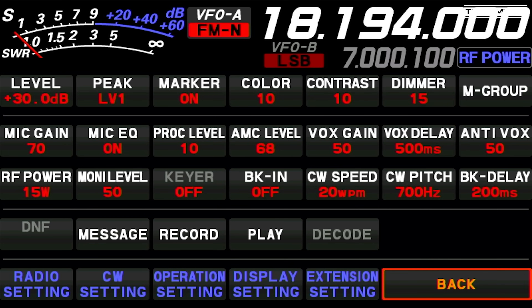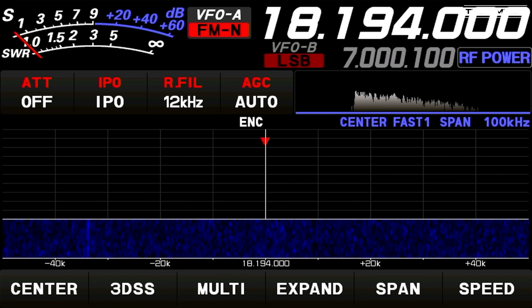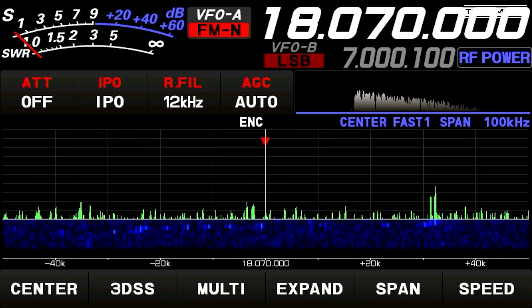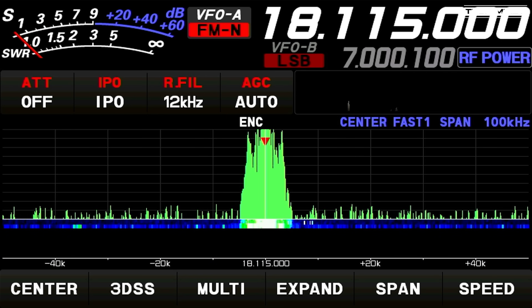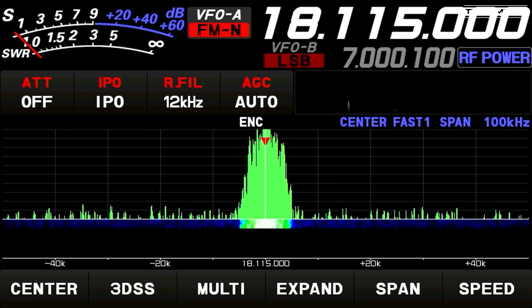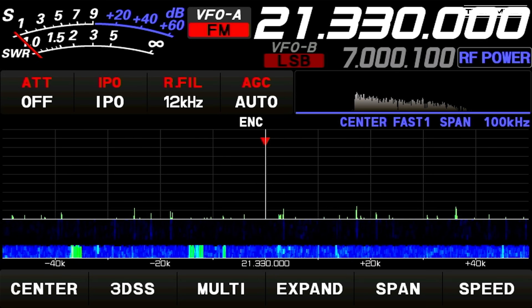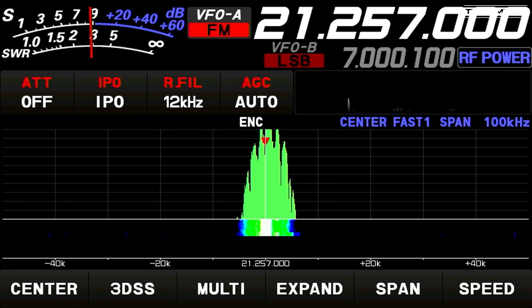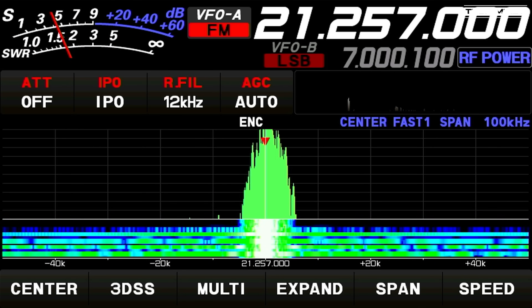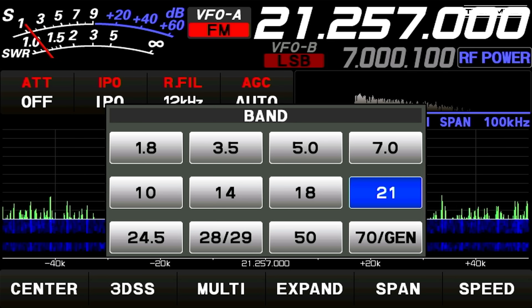Let's first test on the 17-meter band at 18 megahertz. The radio is set between 5 and 15 watts and the mode will be FM or CW. When I press the PTT on the mic, the SWR starts shooting all over the place and then eventually sits at a low SWR — the rapid needle movement is the ATU relays clicking in and out attempting to find a good impedance match. It appears to work on the 17-meter band quite well. Now trying 21 megahertz — it takes a little longer to find a match but does manage to bring it down to a usable 1.5 SWR.